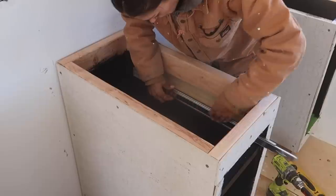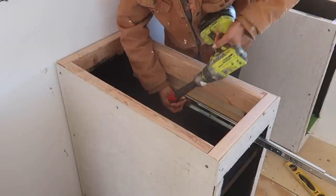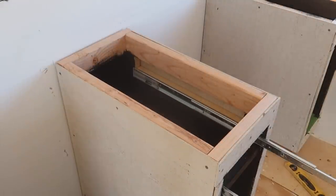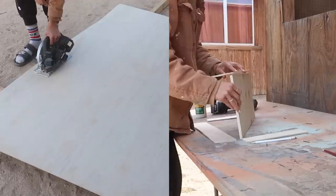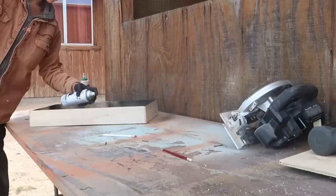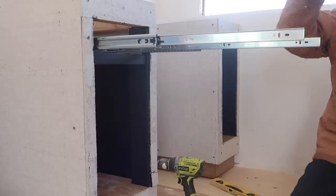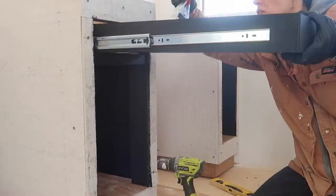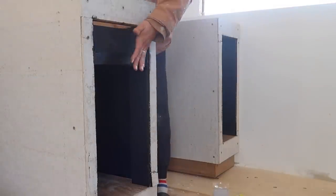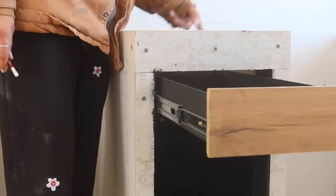Just like I'd never built cabinets before, I've never done a drawer — so I definitely learned from my mistakes. Number one: the hardware is really easy to install, just slide it on out and screw it on in. You see me using a 90-degree angle bit — that red thing attached to my drill — which lets you get into close quarters. I do not recommend using that thin underlaminant for the drawer box; it just felt cheap. I highly recommend using at least a quarter-inch ply. I spray-painted it black to blend in, and once the drawer functioned I capped it with the vinyl wood to keep that chicness, texture, and warmth.